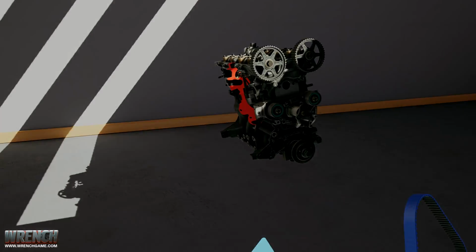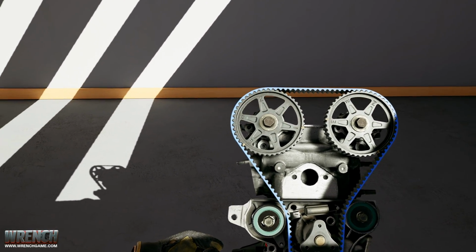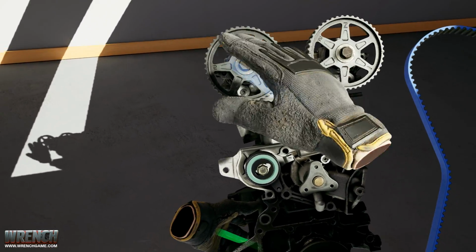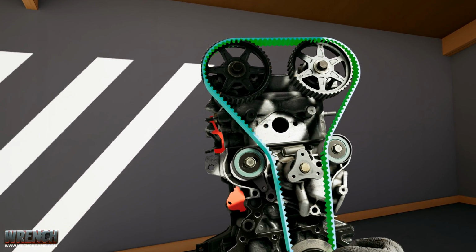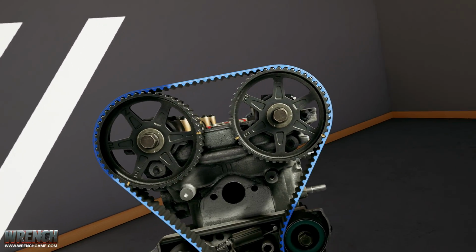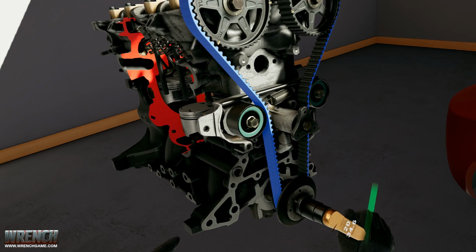And then lastly, one more thing we've implemented is that the teeth are forced to index between the belt and the gears. So if you tweak all the positions so nothing's lined up, and you go and put the belt on, you'll see everything moves just a little bit, just to force it into alignment. And that just prevents the teeth from the belt from sticking into the gears.